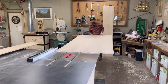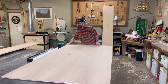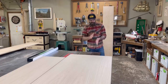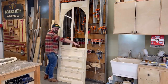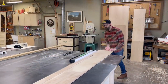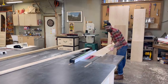Then I pulled out some white oak veneered ply. The inside of the cabinet is just going to be finished wood grain and the outside is going to be painted — kind of a two-tone look. Although I'm using birch on the outside, I wanted a nice veneered ply for the inside since you'll see it through those glass doors. The first piece of oak ply I cut down is for my middle divider shelf — it'll sit right behind the face frame so you'll see that oak through the door. After cutting that panel to size, I started chopping down some pieces of three-quarter inch ply for all my bracing and support structure of the rest of the cabinet carcass — all unseen components that keep it from falling apart.